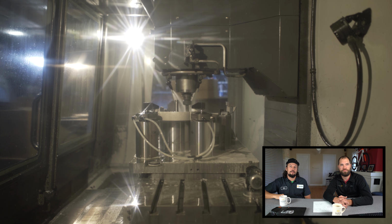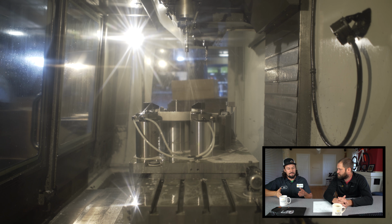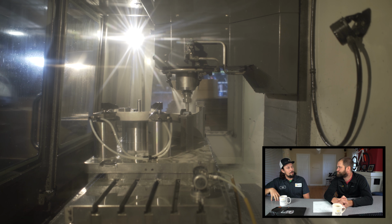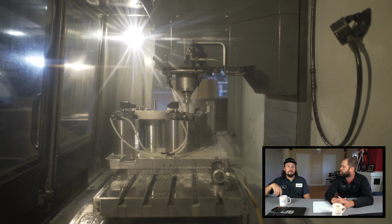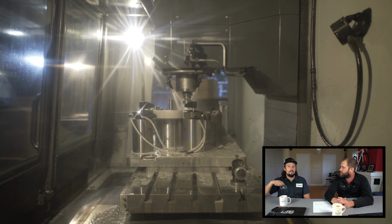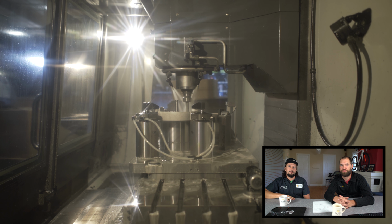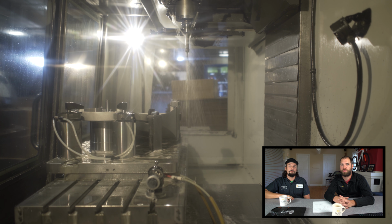You're mentioning Jesse and our machine team here. When we initially set this up, our machining process was closer to that 17, 18 minute mark. We gave these guys a green light to do whatever they could to speed it up while still maintaining quality. They found ways to change the path that the machine's moving in-house and sped up some tool changes. Instead of changing some tools, they just keep the same tool in there. We were facing with a different tool than we were using to clean up the bearing surface, and they went through and reduced some of those steps. Taking steps out takes time out and allows us to keep up better with the demand.